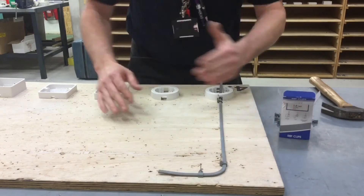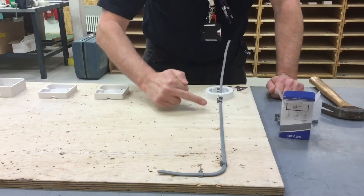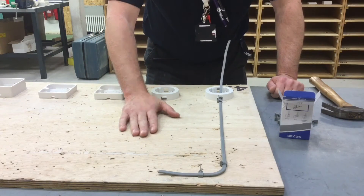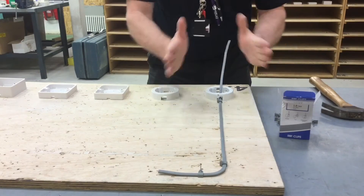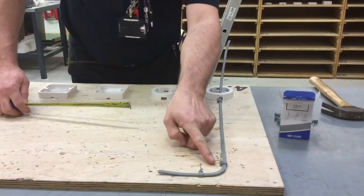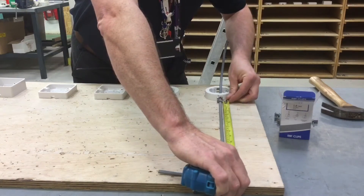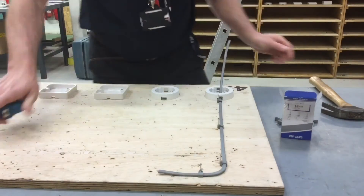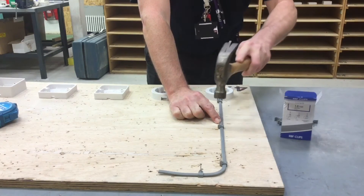I'll step back and have a look — am I happy? Is it straight with a nice smooth bend? If the answer is yes, then we can go with that. That clipping distance is one we're presuming; we haven't looked in the regulations for the maximum clipping distances. But because this is our first exercise, we're probably going to halve the distance. I like that distance for a clipping distance. We're going to put one in the middle of that position — just take my tape measure and measure between the centre of the two clip positions, halve that, so I'm going to be about 18 centimetres or 180 millimetres, and drop the clip in. Just pull it slightly across to make sure we are straight down again, then pin it.